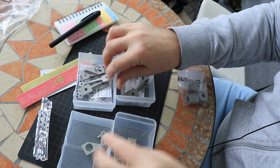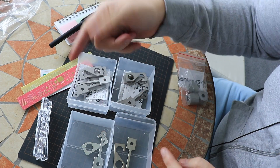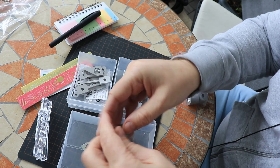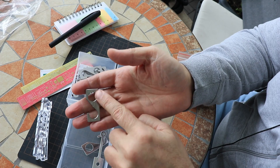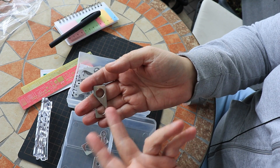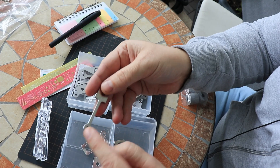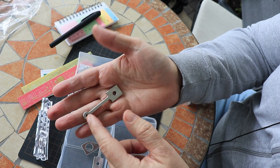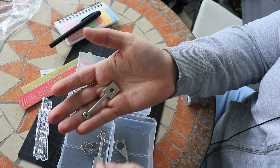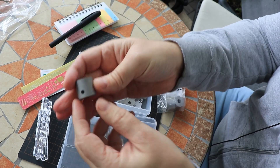And then of course the main part: these are 3D printed from aluminum and stainless steel, and these are CNC machined. As you can see, I have one per each for CNC and three pieces per each for the 3D printed ones. So I have these hooks — with these I can test some tensile and bending stress and see at what load they will break. With these other test objects I will put some load, fix this part, and measure bending deformation in millimeters without breaking.